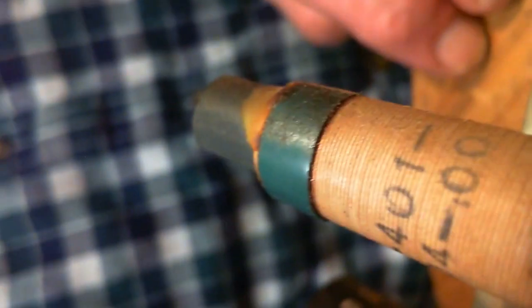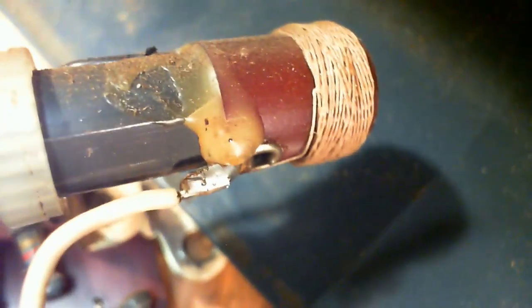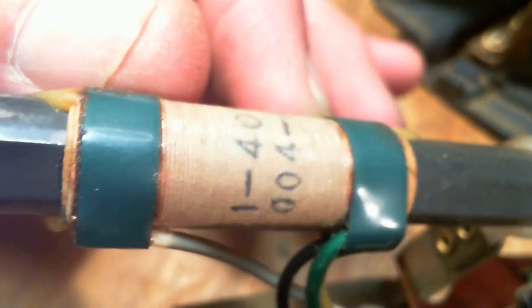And we look at the antenna. Antenna's got some writing on it here. Don't know what it is. We got a coil here with four wires. And way down here is another coil. Special winding technique being used there, trying to reduce the amount of time wires are parallel to each other. I'm not sure what that coil is out there, because this guy's got a bunch of wires. He's got four wires. This coil is analogous to that crazy thing I had up on my bench earlier that I was tuning. It's just this one's done with a ferrite rod. Some kind of rod.